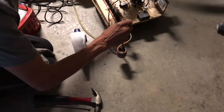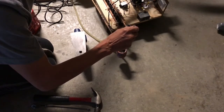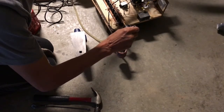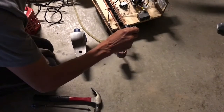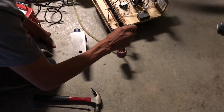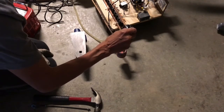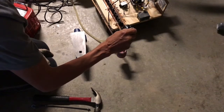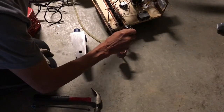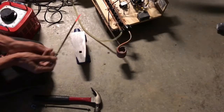I'm going to stop tuning this thing into resonance — you can hear it buzzing. We're getting heating, as you can see there. I've got about 80 volts across my half-bridge inverter. Good amount of heating here. Now time for hammering.